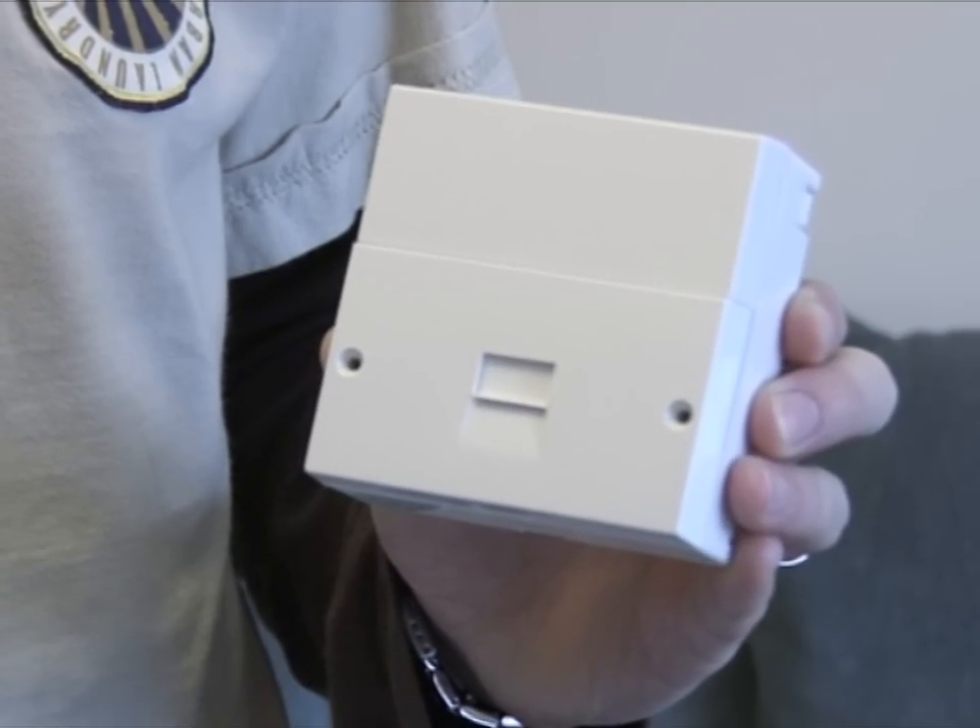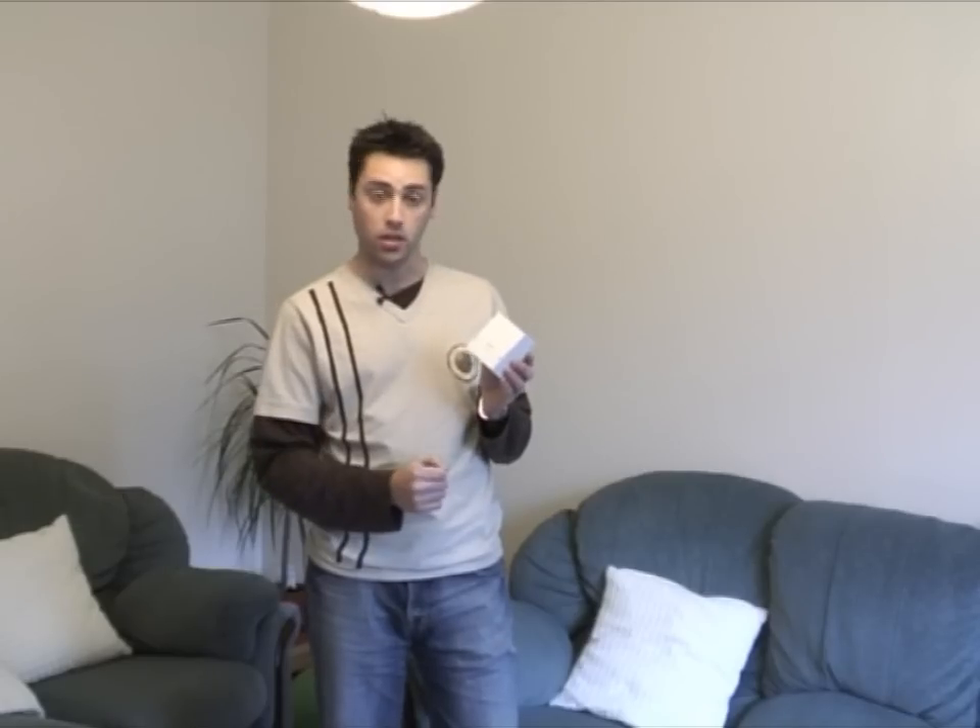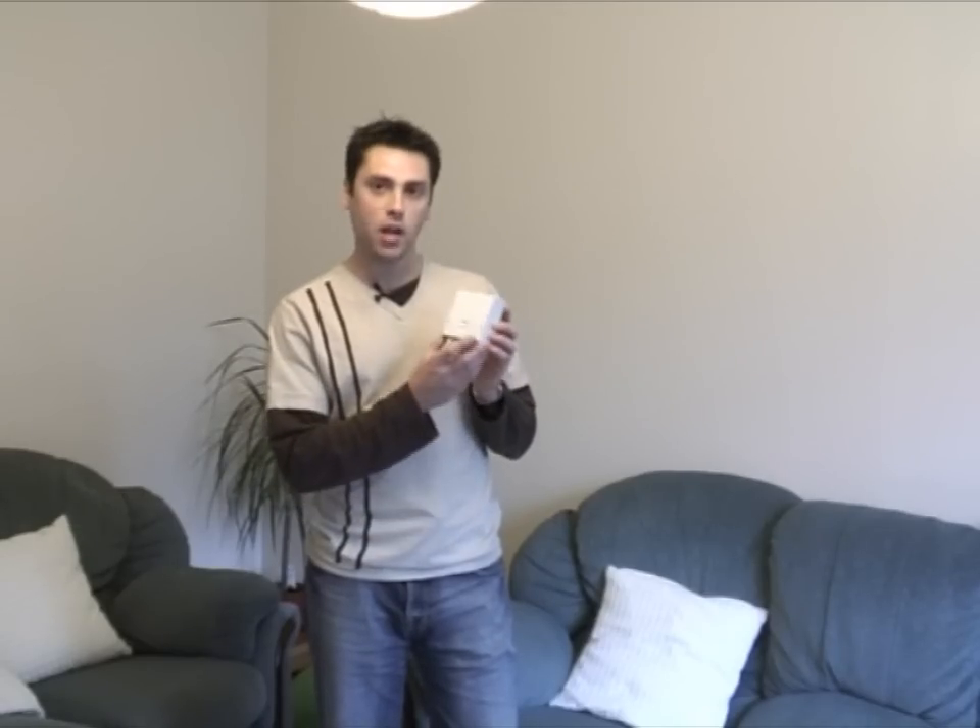The next thing, you'll need to actually identify where your master socket is in your house. It's often in your front living room or hallway because it will come in off the road usually. Now the socket you need is the BT-NT-E5, easily identifiable because usually you have a BT logo. This is actually a third-party one available from a company called Solwise — that's solwise.co.uk. So if you do have an older type, you can purchase one of these for about £15.